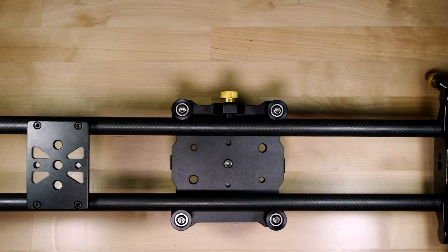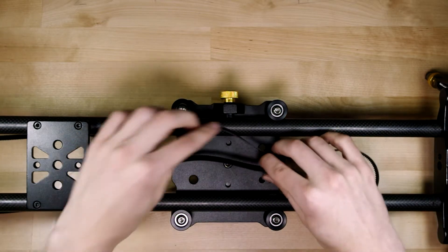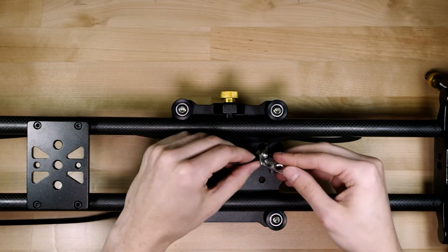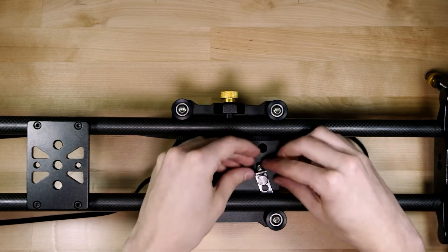It's time to actually start putting the pieces together. There are a lot of holes on this slider, which was one of the main selling points when I bought it — it makes mounting things like this really easy. It's worth mentioning that I did a test fit of everything before I actually cut down the belt; with the motor and pulley in place, I ran it over the path it would take and added an extra half inch before making the first cut, then trimmed it down an eighth of an inch at a time to get it to the perfect length. We'll grab the belt and its mounting bracket, bolt it to the underside of the carriage, then mount the non-drive side using a split locking washer, bolt, and regular washer, and then mount the motor using the same combo.